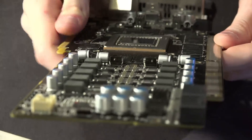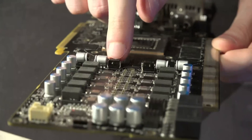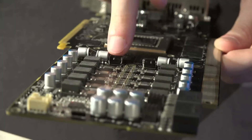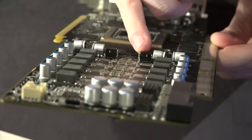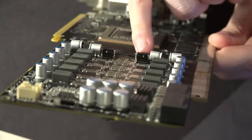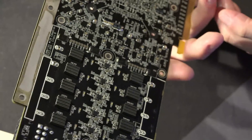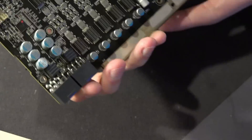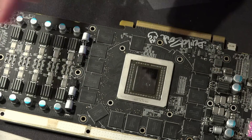We actually have some — these are the really expensive Panasonics right here. These are 3 milliohm ESR 470 microfarad Panasonics, and I've just stacked them right on top of what was already on the card. These work great, except when I tested these as working really well I think I was using like five times as many of them. There's not that many here, but as I kept adding capacitors, the scores did get more consistent.